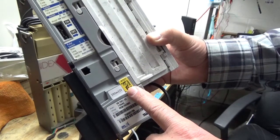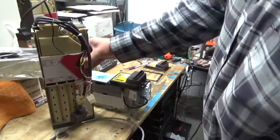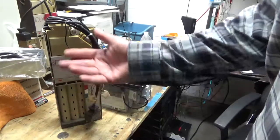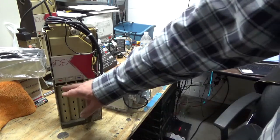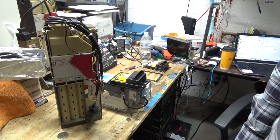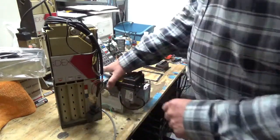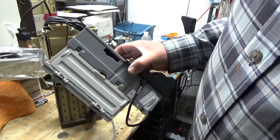Some people still have the 2400 series — this is a little upgrade, a 2500 series. Even though this one accepts new fives, you can put it in a single-price machine. I don't recommend it because you're running a three-tube coin mech that only holds $18 to $20 in quarters depending on the model. If you sell four cans of Coke at a dollar each, you're giving back $16 in change across four sales and you'll soon be out of change. Some people do it where they want to take a five — they don't have a change problem if it's a small business that knows quarters are best.